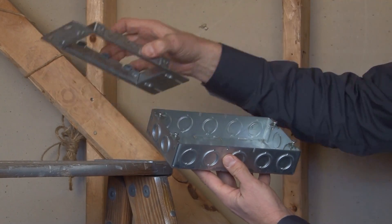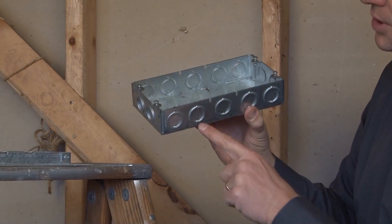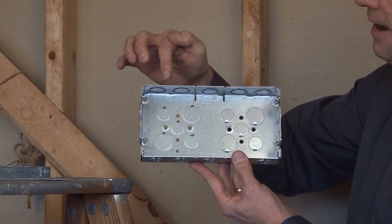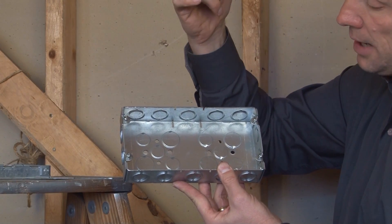This device ring is sold separately in both half and three-quarter inch raised versions. GB1583 is one and five-eighths inches deep, with half and three-quarter inch conduit knockouts on the sides and straight half and three-quarter inch conduit knockouts in the bottom.